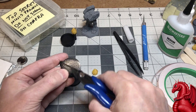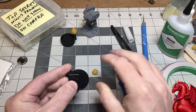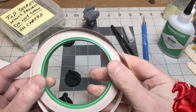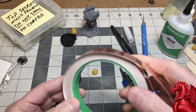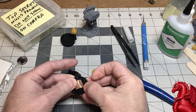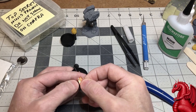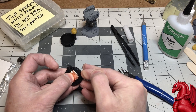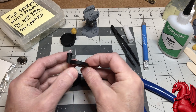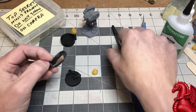The closest lead to center you're going to fold over and put into that trench. If your lead is just a little too long, nip it with some wire cutters — as little as possible — so it fits in that trench. This is where the copper tape comes in. You can get this for about five bucks on Amazon. Cut a couple swatches and use that to hold the lead in place in the trench. Layer multiple pieces to get the depth you need — go ahead and put two pieces on at this stage, then press them down good, making sure those edges are pressed down so it doesn't peel up during use.